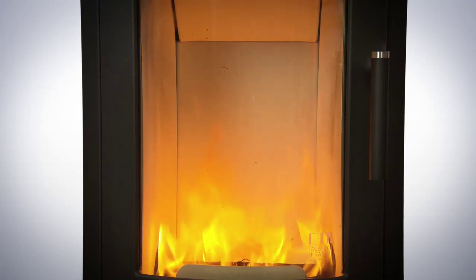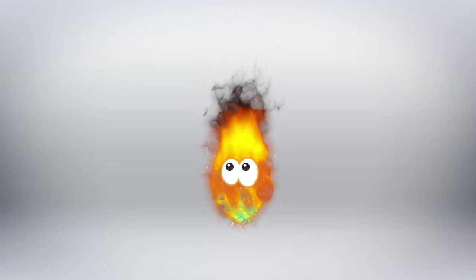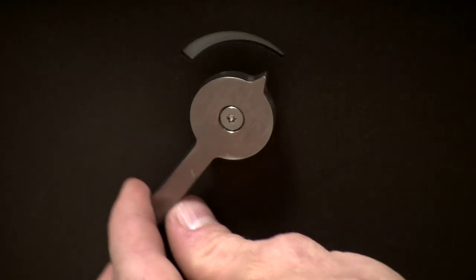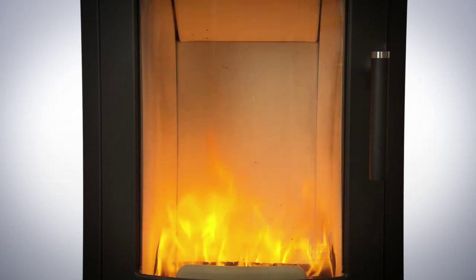It's best to try and observe for yourself how the fire reacts. If the flame tips are black or if the flames are blue, the fire does not get enough oxygen. Please note, a clean combustion is visible — it shows by a clean glass, a white firebox lining, and the colour of the flames.